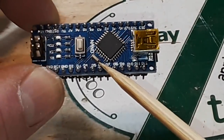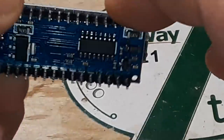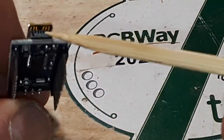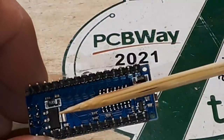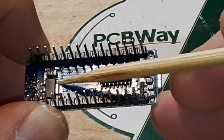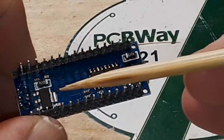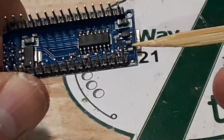There's a crystal that controls the timing to make sure everybody's talking at the same rate. On the back side, we have a USB interface so that we can communicate with the computer via this USB mini connector here. There's a voltage regulator so that you can put in — I wouldn't go over 12 volts, but I think you can put in up to about 20 volts on this. Keep it 12 or under though, because excess electricity turns into heat. Some capacitors, and really that's about it.